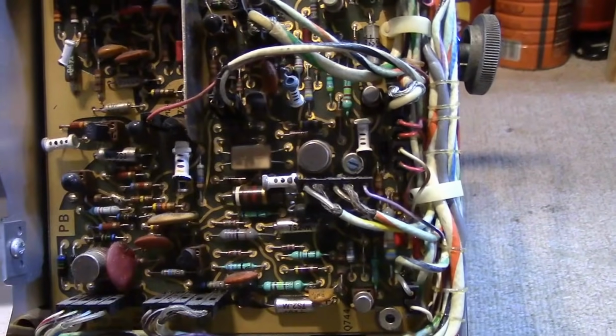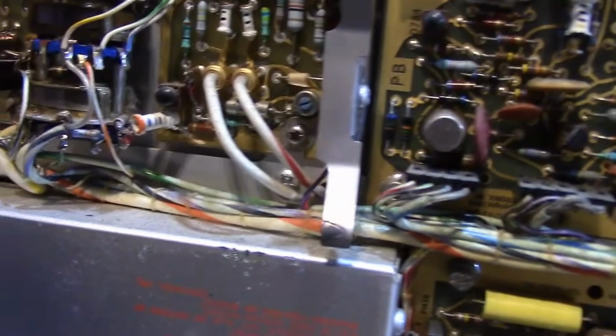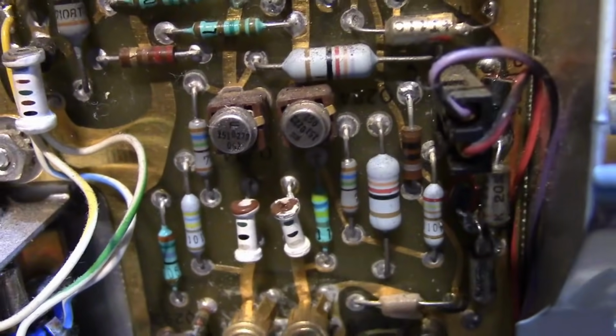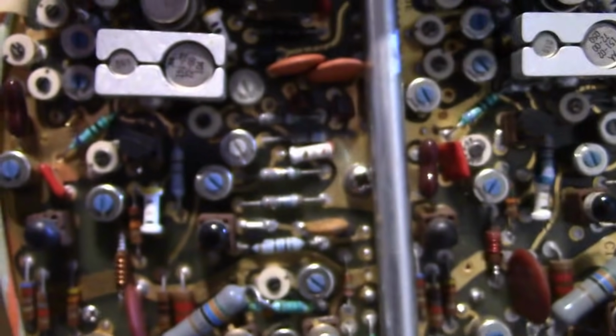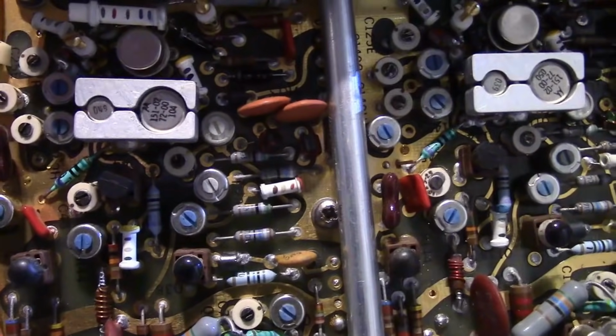Pretty though. Looks like they're gold washed circuit boards. Every transistor appears to be socketed. A range of styles, from little plastic domed ones to little metal ones. I've never quite seen anything like that before. More conventional packaging style on those guys. And then some like that, where that's for getting into this exotic stuff, where that was probably not just for heat sinking, but to thermally match those two components.